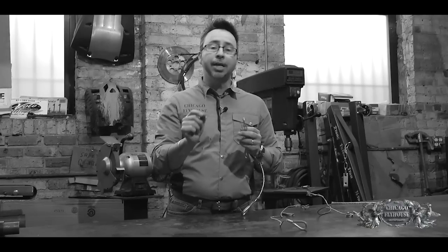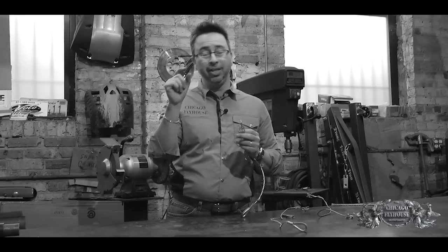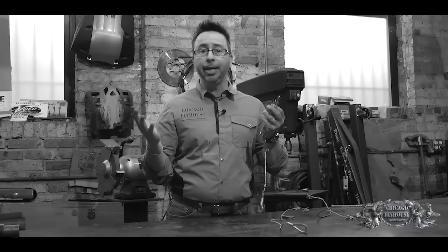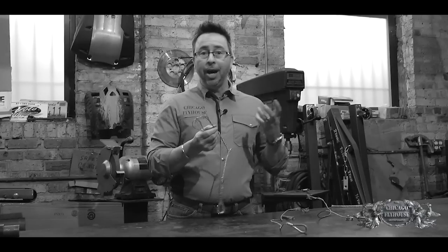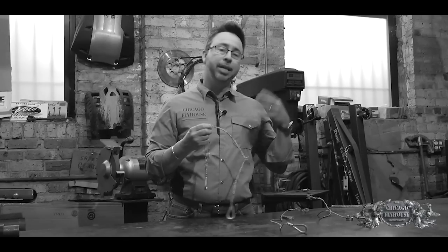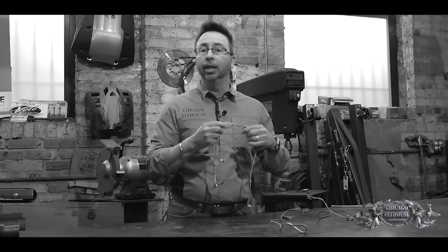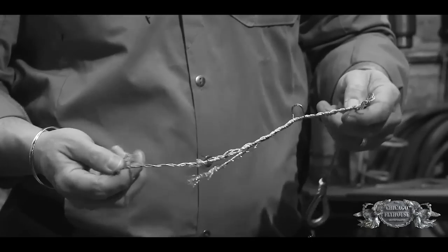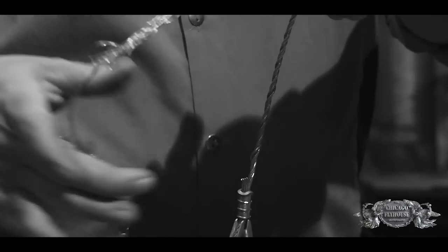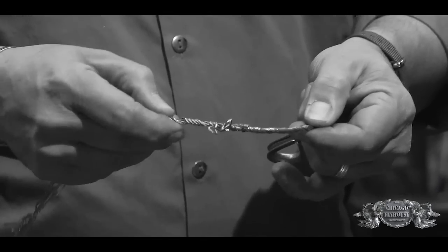What I want to emphasize here is not to focus on a mere loss of 10%, but focus on the fact that we did lose a significant amount of its capacity — and that's completely variable. You don't know what that's going to be. So should you retire wire ropes that have those severe kinks in them? Absolutely. We see those a lot, mainly on the arena side of things, convention center side, where stuff's going over I-beams and getting a lot of pressure on them. So look inside, look at that, and see if there's any gaps in the wire rope, see if there's any hard lines. If you do see that, or you see something as pinched as what we did for our experiment here, you're going to want to take it out of service.